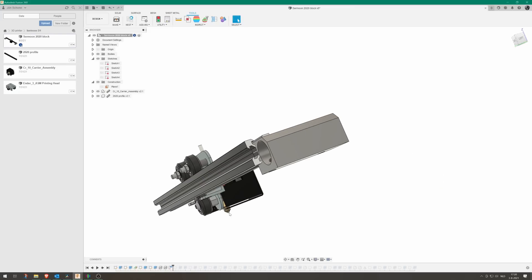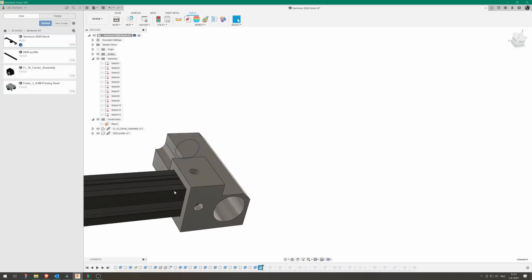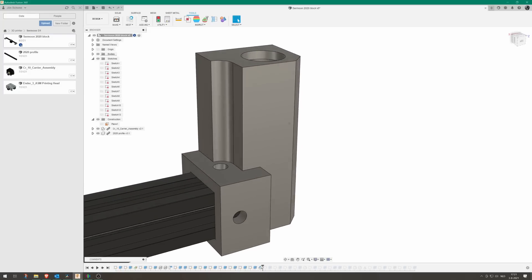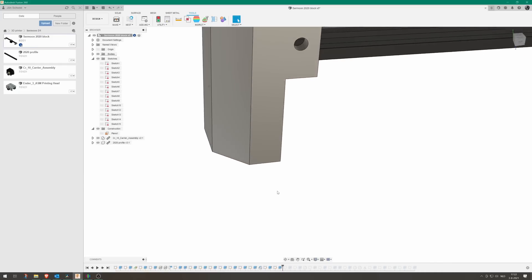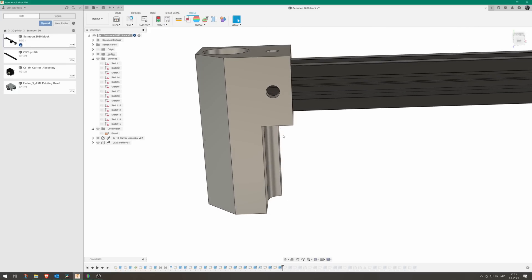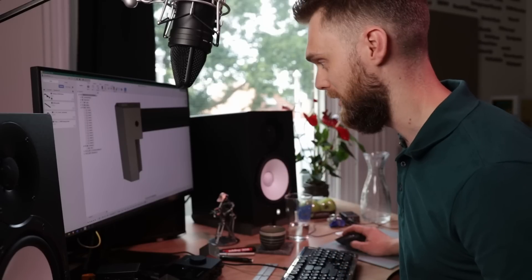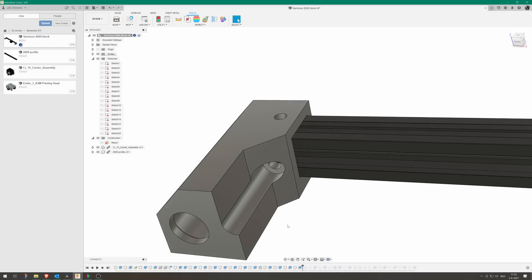Take some measurements and check if the dimensions are correct. I've placed the nozzle position at the same position as the original nozzle, and I added a chamfer here at the inside. To make it better printable, my idea is to print it in this orientation. So if I have an overhang like that, I always check if I can add a chamfer to that so I don't need support. I had the idea to print it in this other orientation, so I added a 45-degree angle, but it turns out I'm not going to use it. I thought it looked pretty neat, so I just kept it.